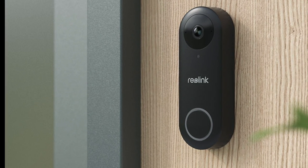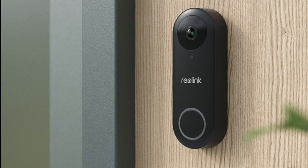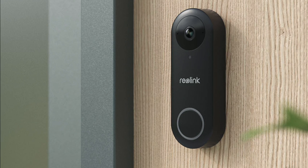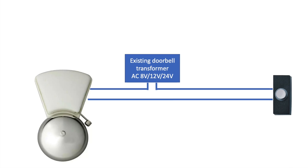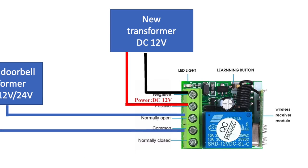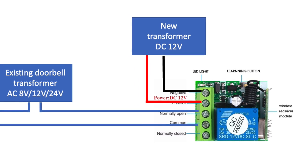This wireless signal can be used in combination with a standard 433 MHz receiver. This receiver can then activate your existing doorbell chime. It is easy to do this. Disconnect the doorbell switch and connect those wires to the wireless receiver. This receiver will act as the doorbell switch.